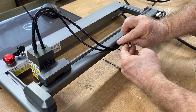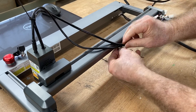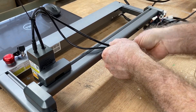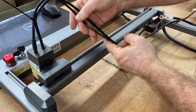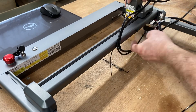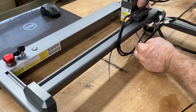You don't need to have it real tight — if you get it too tight, you're going to pinch the air hose and won't get the air needed to reach that laser head. One more tip: don't forget there's a belt right underneath there. If you're not careful when you stick that zip tie in, you might catch the belt underneath. Please don't do that — check and double check to make sure the zip tie only goes through the hole, not capturing the belt underneath, and then securing the cable and air hose.